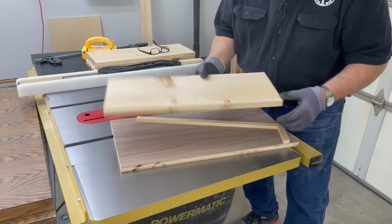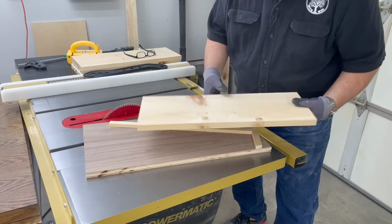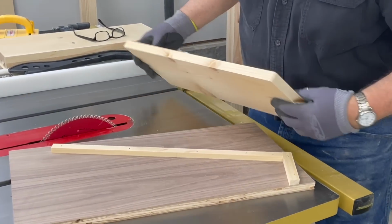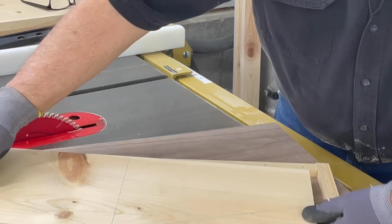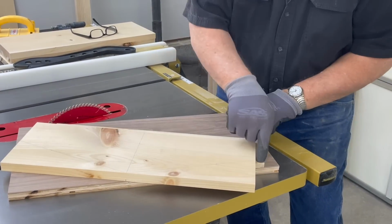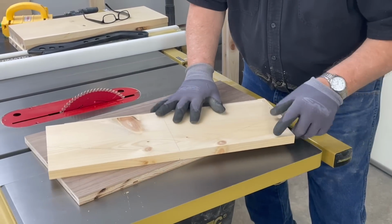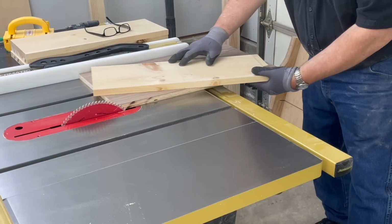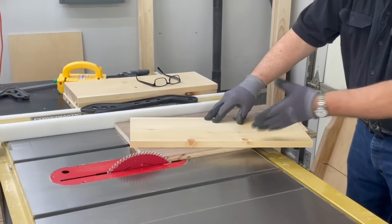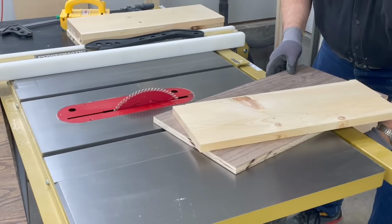We're getting ready now to cut our angle pieces. We're just going to use a homemade jig that I make that holds my board at an angle. What I did is I marked 4 inches on the side and 8 inches on the top, and I lined those 2 marks up with the edge of my base piece, and then I nailed a cleat on the back side to hold my board in that position, and we'll run that through the saw like this. It will take that piece off, then we'll flip it around, and we'll do the same thing on the other side, and that will give our 2 angle cuts on the top, and we'll do that on all 4 pieces.